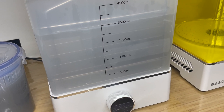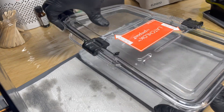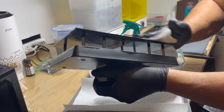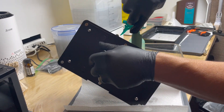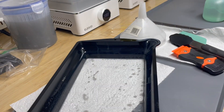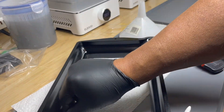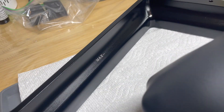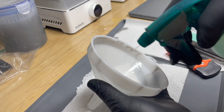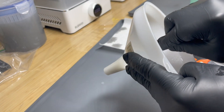While the parts are being washed, I do a little resin cleanup. To clean off the build plate, I have a sealed container with IPA alcohol in it — I simply place the build plate into it, then wipe it down really good and use a spatula with a paper towel to get in there and clean out all that resin. Then I spritz the resin tray with alcohol and use a disposable shop towel to get out any excess resin. I even use a few q-tips to get into the nooks and crannies. Then I clean up the other tools using alcohol and paper towels. A good way to clean out the funnel is to take a piece of paper towel with alcohol and push it through with a popsicle stick.